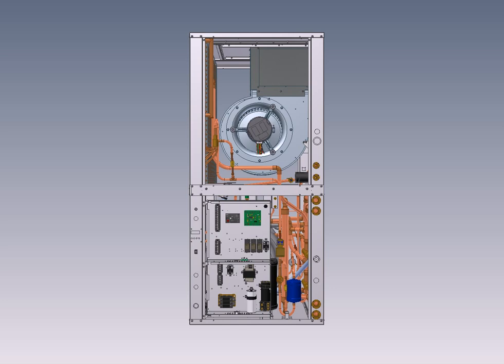We use a non-proprietary thermostat interface, which means you can buy one of our several models of thermostat or use any other thermostat. The relay logic has a call waiting feature. For example, if the unit is operating in air priority and air mode in only stage one, and a hydronic demand becomes active, the unit will switch to air mode stage two to satisfy the air demand as soon as possible and get to the waiting hydronic demand. The unit won't run in stage one while there's a call waiting.